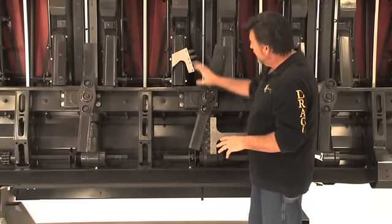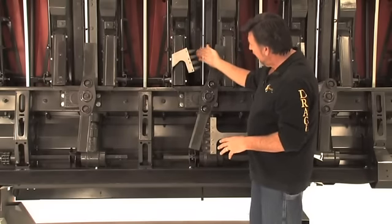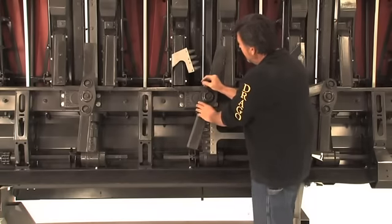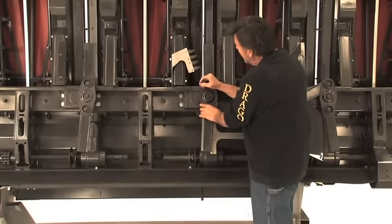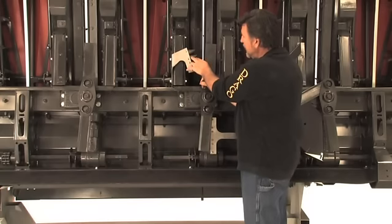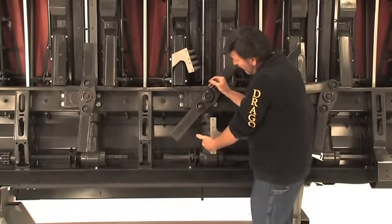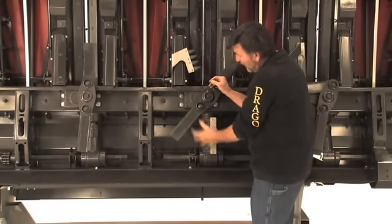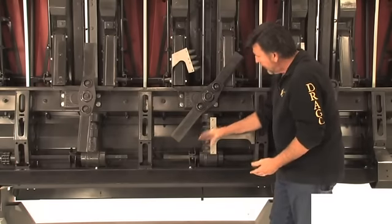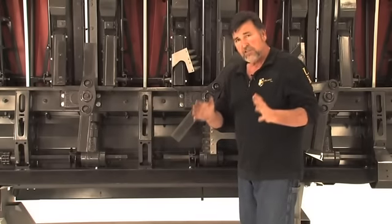Now what we've done is added a front stationary knife, but using sickle sections that add another level of shredding to the stationary knife. That means as the chopper blade comes around on that leathery stalk that tries to bend away, it's caught in the jaws of the sickle section and chewed up and shredded. And then, again, as the stalk is going through, if we have a straggler, the rear stationary knife has another chance to clean that straggler up to give you that even, crisp look of a chopped field.